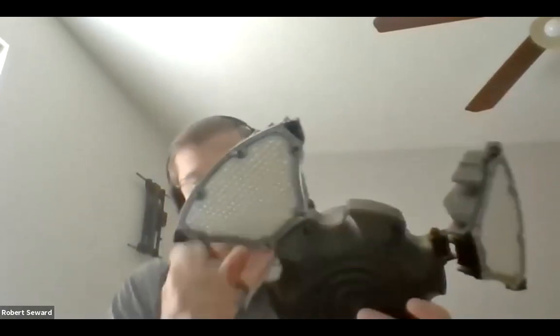You can see the mounting options here. This is the traditional hook, and it comes with a clevis just in case you need it. We can also do the rigid mount — your three-quarter inch rigid conduit coming out of the ceiling that threads right in. It also comes with all your safety cable included at no extra charge. If you don't want to use it you can remove it, but it's already on there if you need it. Each wedge is at an 80 degree beam angle, but you can change it by tilting.